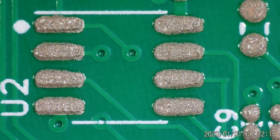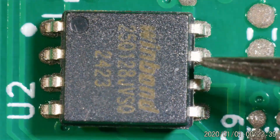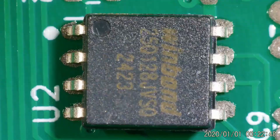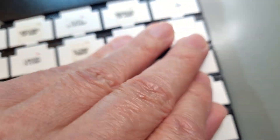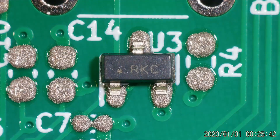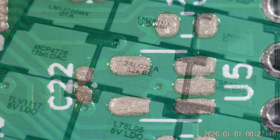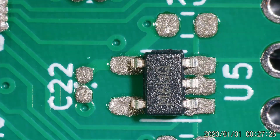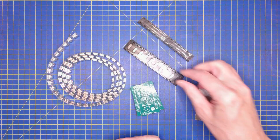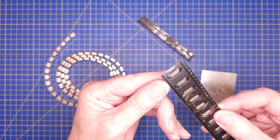The flash is a wide SO8, and as you can see it's wider than the regular SO8 package, so to make it fit I had to bend the legs a little bit. This issue is of course fixed on the second spin of the PCBs. The voltage reference diode is a regular SOT23 and provides 3V for the ADC reference input. The EEPROM is a small I2C device in a SOT23-5 package. The crystal is the recommended type for the RP2040, taken from the hardware design guide.